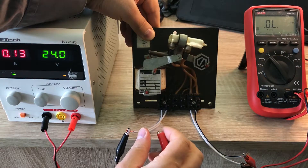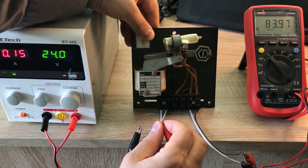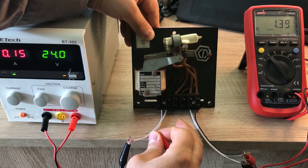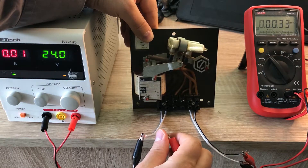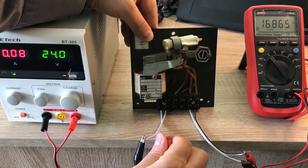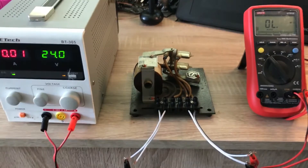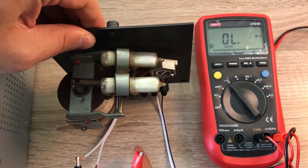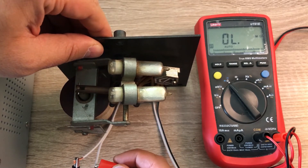This is how it works. It's very interesting, because when I touch this wire and disconnect the coil, I also get a tiny shock, because this is an inductor — when I open it, it produces an overvoltage. But basically, this is how the switch operates. Let me show you also from the other direction, from the vertical position.